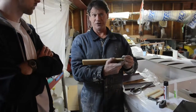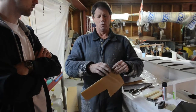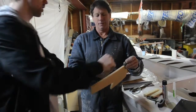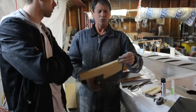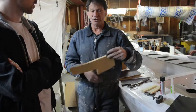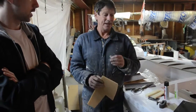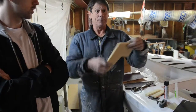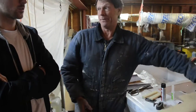You want to tie your skins. Got to tie your skins. Biggest thing, once you've tied your skins, you don't care what happens to this core. Can you do that just from outside, or would you do it first and then do it on top of the tube again? Yeah, do both. You don't have to put too much laminate on it, but just make sure you got these guys tied. And then just tying them from the outside is enough? Yeah. Or you could tape them. Tape them? Wow.